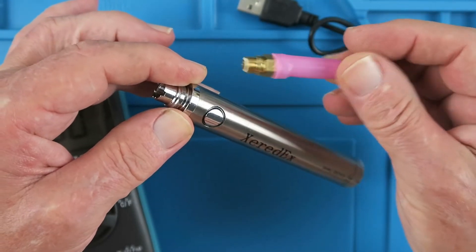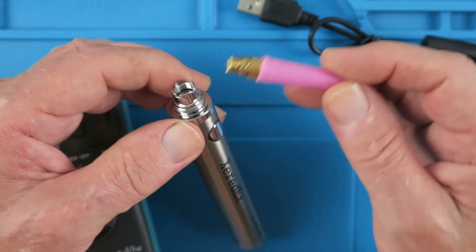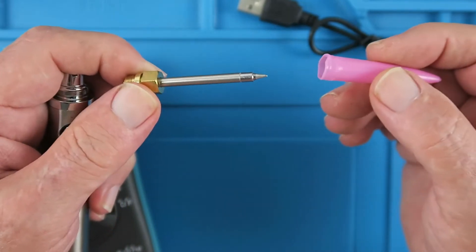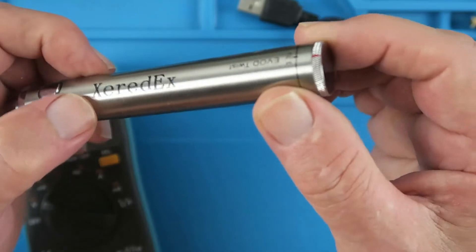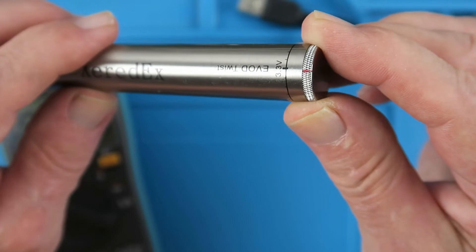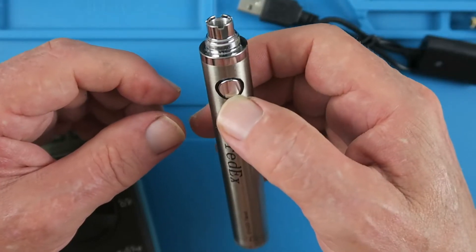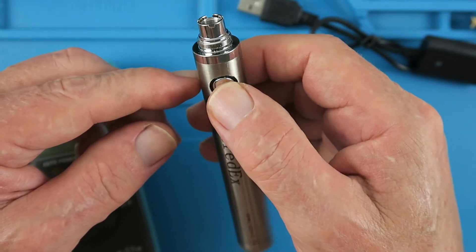This has clearly just been adapted to the role of a soldering iron. Knowing that, you could either convert this into a vaping battery or turn any vaping battery into a soldering iron. Turning our attention to the battery, there is an adjustment at the end which runs from 3.3 volts up to 4.8. To wake the device up, you have to press the on button five times in quick succession.